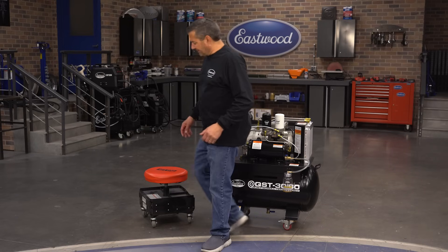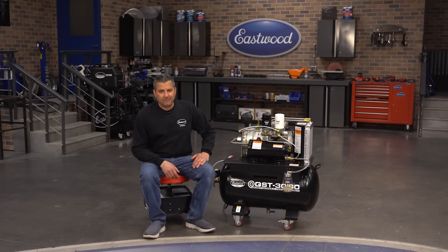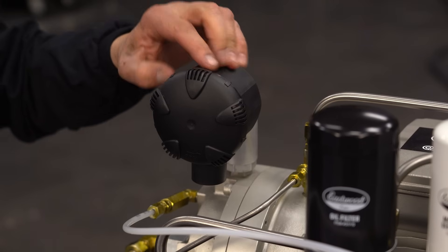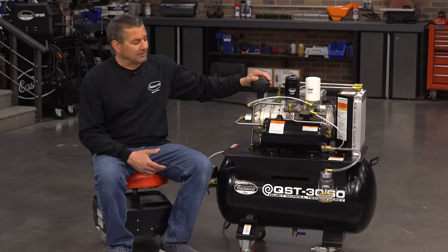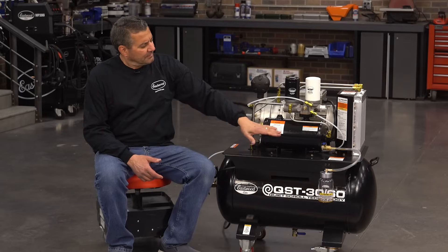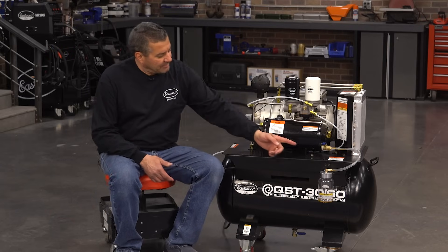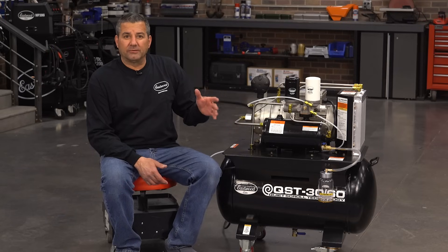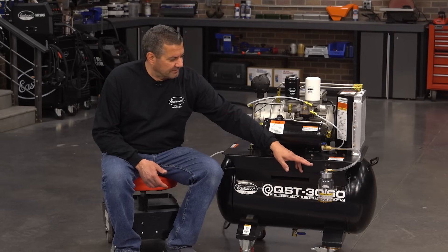So we talked about the scroll technology and the benefits — but what about maintenance? Is that a hassle? No, it's not. It's no different than the compressor you've got right now. There's a pleated air intake filter here — if you're not blowing sawdust or bonded dust directly into it, that'll last a lifetime. Two spin-on filters, you know how to replace those. There's an oil tank — yearly you're going to replace the oil, about two quarts. There's also a drain kit: depending on humidity or your usage, you may accumulate some moisture in the oil tank, and this simply drains that out weekly.